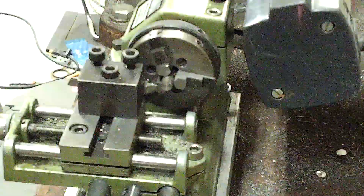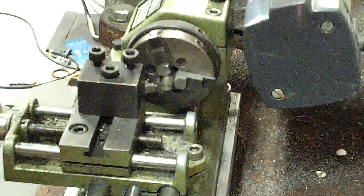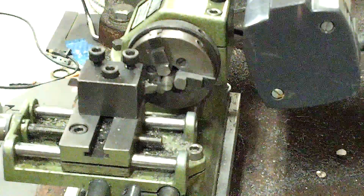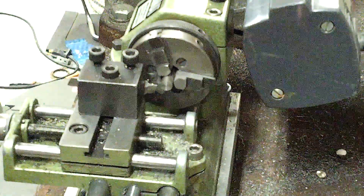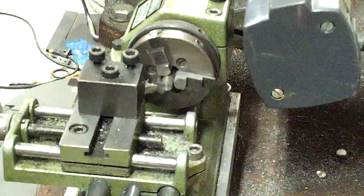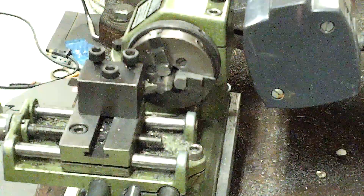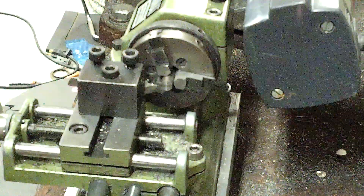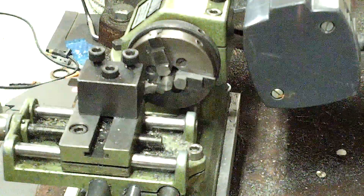Like I said, this tool is probably a little bit low, but I didn't want to raise it any more with paper or anything because then it would have been too high and I'd be doing more rubbing than cutting. You will get a little bit of chatter at the beginning. I tried it at a lower RPM and it just doesn't want to do it. Higher RPMs would probably part a little bit better, but if there's ever an issue you're going to junk your work. So it appears that on this particular material, 685 RPMs was able to part on a Unimat. Thanks for watching.